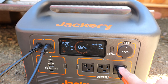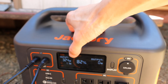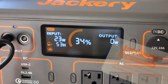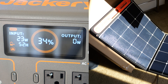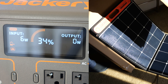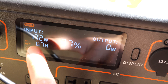I've got an extension cable going to my microwave. The input is reading 324 watts. To charge about 20%, it requires 1.1 hours, so a full charge takes about five hours in full sun — which is great because you can still charge it on a partly cloudy day if you charge the whole day. The display times out after 30 seconds to save power. I'm getting 23 watts right now. If I block out one square, it doesn't reduce much; block four squares and it drops to about 12 watts; block nine squares and it drops 75% to about five or six watts; block half the panel and you get zero watts. In the corner it says MPPT — Maximum Power Point Tracking — meaning it tracks the voltage and puts the proper load on the panel to extract maximum wattage.